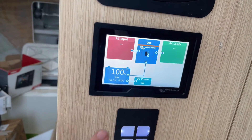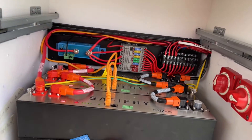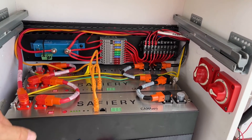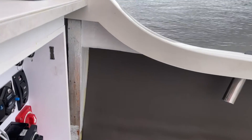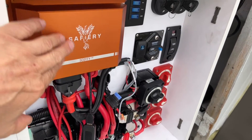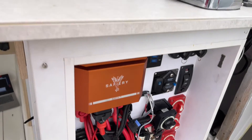We've been running around for an hour and a half now and the battery's at 100 percent — I can't get anything more into the batteries for our testing. So just while we're resting, that's our 48 volt system here. A couple more supports to go in, then a covered front, and we've got all our fusing at the back. That's the isolator for the gyro, and on this side we've got a temporary switch, plus the 12 volt bus coming in with a cover, and the isolators on port, starboard, and the combiner.